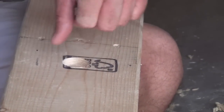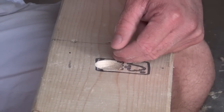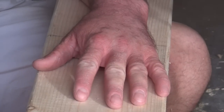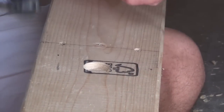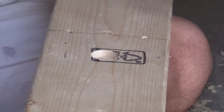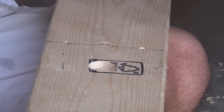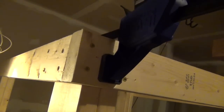Take your time, make sure that everything is centered and measured from the bottom up precisely, and from side to center as precise as you can get it. Once I'm finished punching all these biscuits out — this is my last one — I can get these started. The easy part now is to get them aligned, put them in their appropriate places within the base, then slide the safety bars through them, and that'll hold them together while I construct the rest and tie in the tops and bottoms.